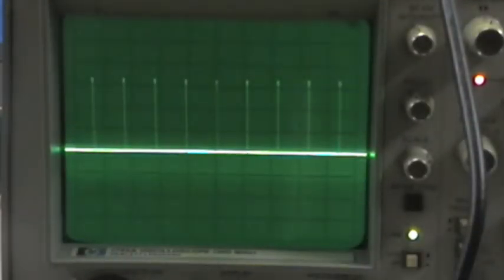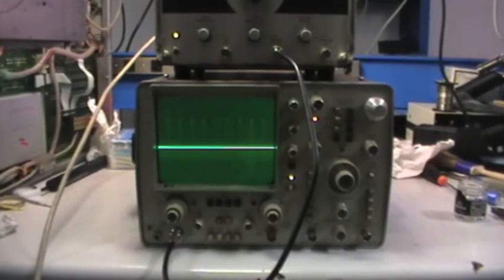However, if I look at the markers here, they are pretty fine, so it's not clear to me why this line is so thick, and actually I don't like it. I have checked all the ripples and they are perfect, so the only thing that remains is some noise that is running in the instrument for some reason, or some misadjustments in the high voltage section, or it's simply a design that behaves like that. So it's time to do the complete alignment and see how it will be.